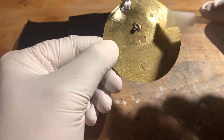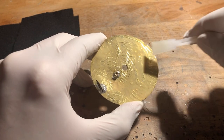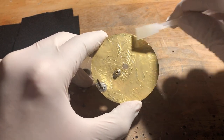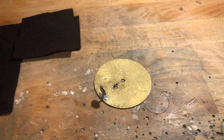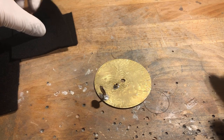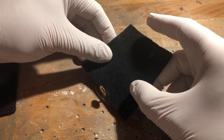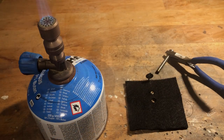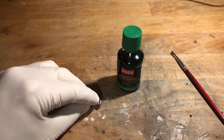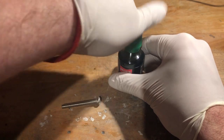Again, I use the same 2-component epoxy resin. The two fastening holes can be punched out by heating a screw of the appropriate diameter. An M6, 50 mm stainless steel screw is used to secure the plate electrode.